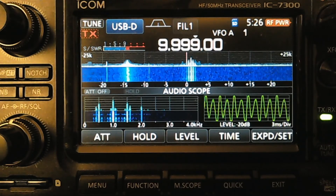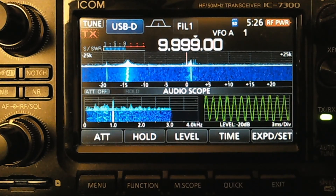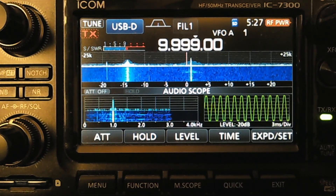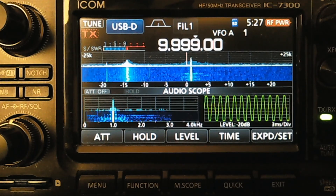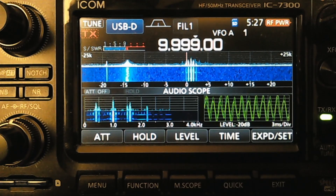This is how you calibrate an HF radio. Listen for those time stations, set the reference tone, and make sure those two tones are absolutely identical — then your radio is dialed in. This has been a KM6LYW quickie. I hope all of you are enjoying your digital modes with your radio properly calibrated. Be sure to like and subscribe, and the Patreon page is patreon.com/KM6LYW. Thank you, big thank you to my patrons — I really appreciate it, and I'll talk to you later.